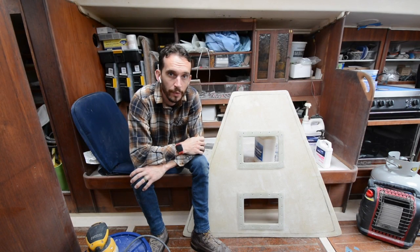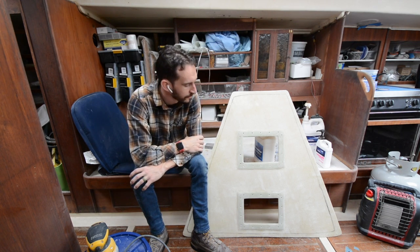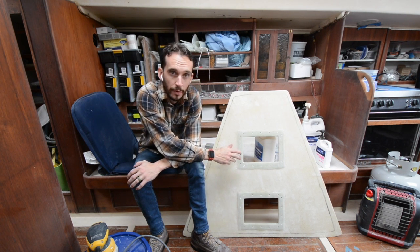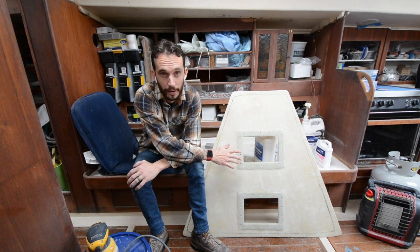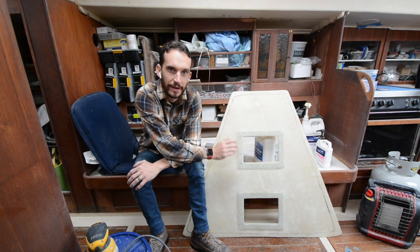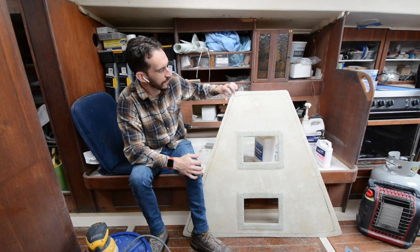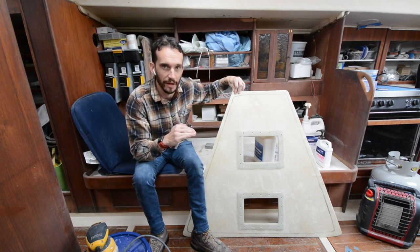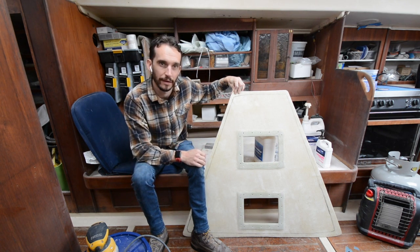All right, so we are pretty much ready to get this thing fiberglassed in up there. Before we do that, I want to coat the inside here with the potable water epoxy from LiQWYD, the Aqua Pura. It'll be impossible or way too hard to do it after the fact, so we want to do it now. But what we don't want to do is get the LiQWYD up here, because we're going to be bonding this fiberglass to the fiberglass lip in there, and we want that bond to be really strong without the LiQWYD in between it.